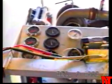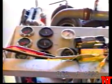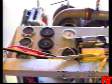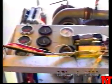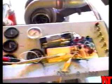along with the instruments, which are oil pressure, oil temperature, battery voltage, 3 fuel pressures, one for primary or start fuel, one for running fuel, and one for afterburner fuel. None of those gauges are hooked up right now. And the clear gauge is the compressor air pressure. The last one is a pyrometer for exhaust gas temperature.